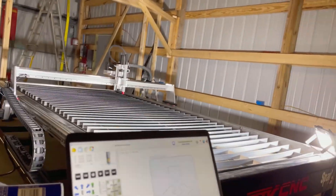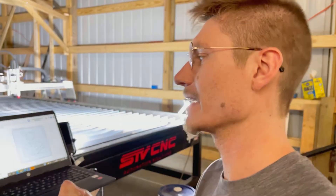Now that we've got everything running, our next step is to see if we can get it to run on its own. I'm going to bring in a DXF file and see — one, that our dimensions are correct, and two, that we can have the machine run on its own, trace out what we want to cut. Then the next step is powering it up and actually cutting.